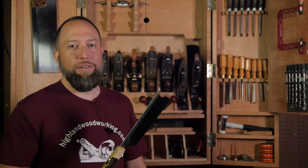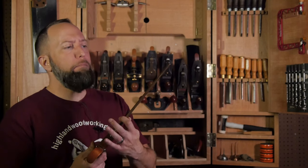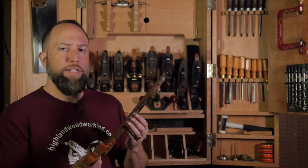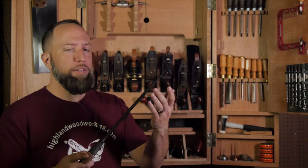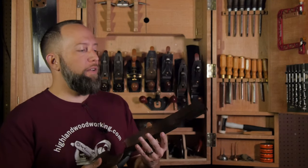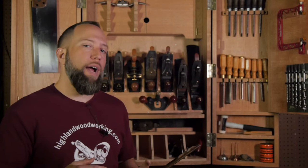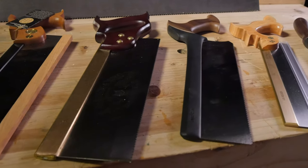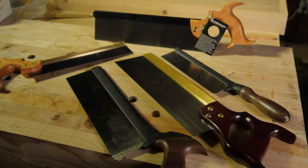Another family of saws called Japanese saws have the teeth oriented such that they cut on the pull stroke as the saw is coming towards you — click the link to see our video on Japanese saws. Now, what if you want to cut some fine joinery, dovetails and tenons? You need a dovetail saw and a tenon saw. What exactly is a back saw? Back saws get their name from the folded back along the spine of the plate of the saw that's there to stiffen and hold it straight. Some modern manufacturers make a back that is integral and non-removable that serves the same purpose but passes on savings in manufacturing to you. The drawback is that if your plate should develop a curve or a kink, you can't adjust it, whereas you can with a traditional folded back. These backs can be made out of brass or steel, with brass being the more traditional and steel being a more affordable option.